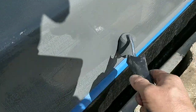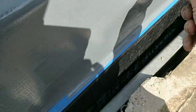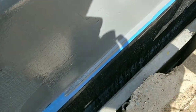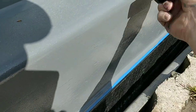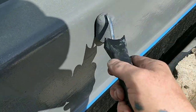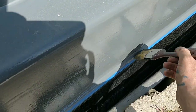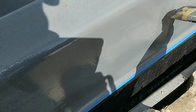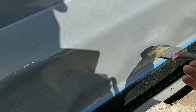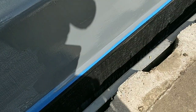Roll it on there, get all the lines out, and then get your brush. I didn't actually thin it out in the end — I didn't really need to. It's gone on quite well. Ideally it really wants sanding back, filling all the little blemishes, ground off and filled to make a really nice job. Just laying it off now — a little bit of brush strokes there, dead simple. Just getting all the lines out, and all the runs and drips.